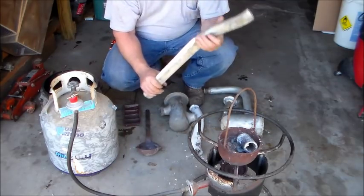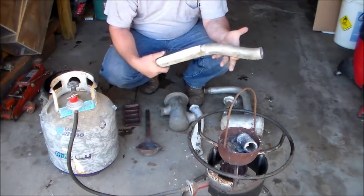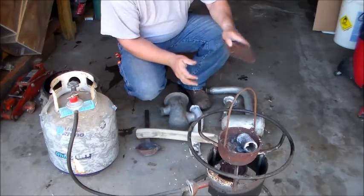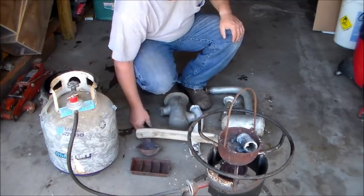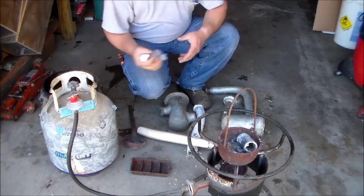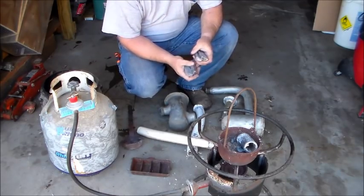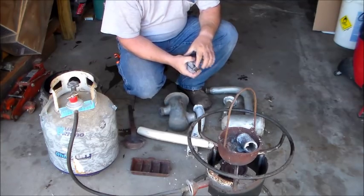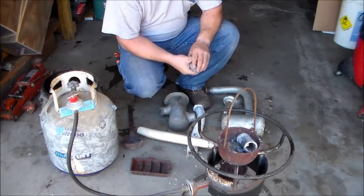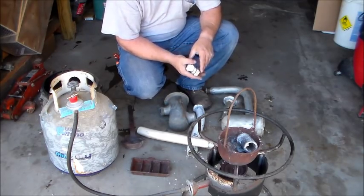You've got your lead waste on them, so that's another 25 to 30 pounds of lead. They're pretty solid but they do bend, and that's why they were used as running arms for drainage. I collect these things up. This mold makes four ingots at a time. You're going to need a lead ladle to scoop out your lead. Then you come up with a bunch of these lead bars — about a pound apiece. They fit smaller into a small cooking pot to pour bullet molds, making jigs, anything in fishing that requires lead. I have just about every mold you can think of for that — bullet molds for 50 caliber and 44 caliber, which is actually a 454 for a 44.